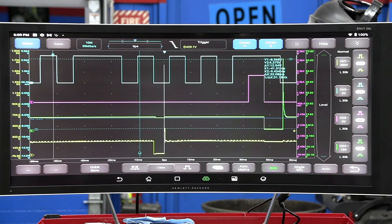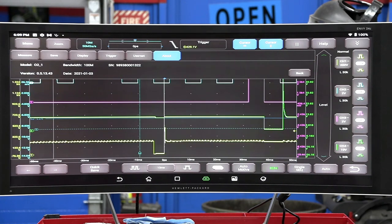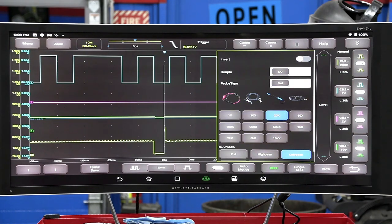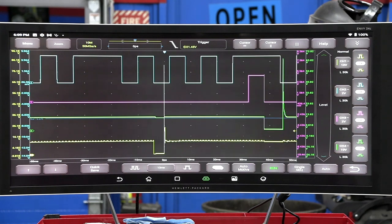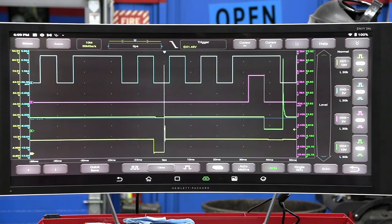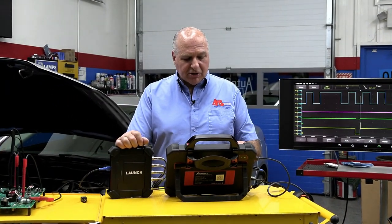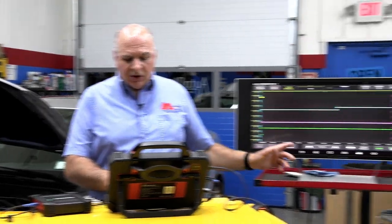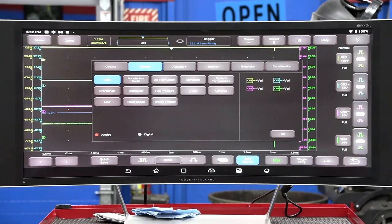It's all encompassed in here. You have a complete menu, the help menu, the math channels. It's as easy as clicking a button when you don't want something on or off. We want to take cursors off — they're all off. This particular scope, you could do a quick save on the bottom — I just saved that particular file. If you're getting a lot of interference on channel one, you could try to clear it up, and you see how that cleared right up? So this is the new Launch Lab Scope with many, many functions. There's also an auto button, but when you're doing more than one channel, look what happens on the screen when I hit auto — it's all over the place.